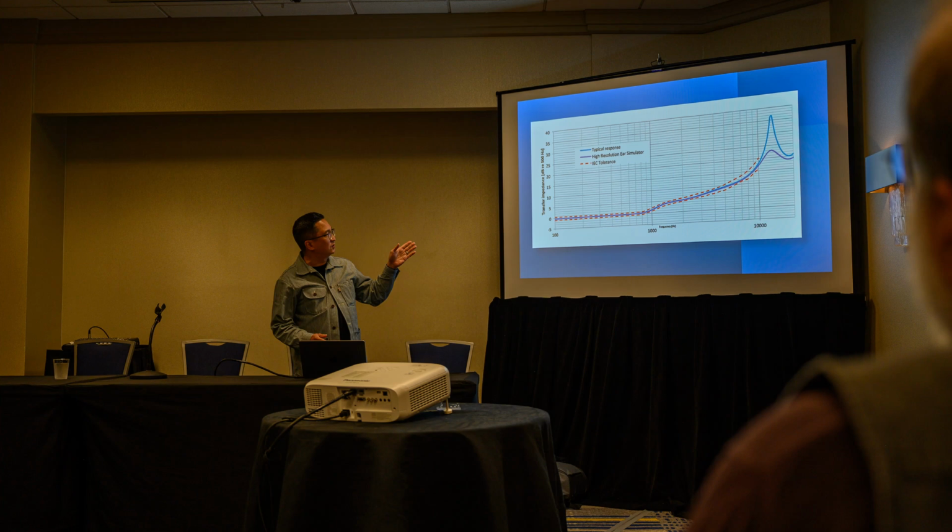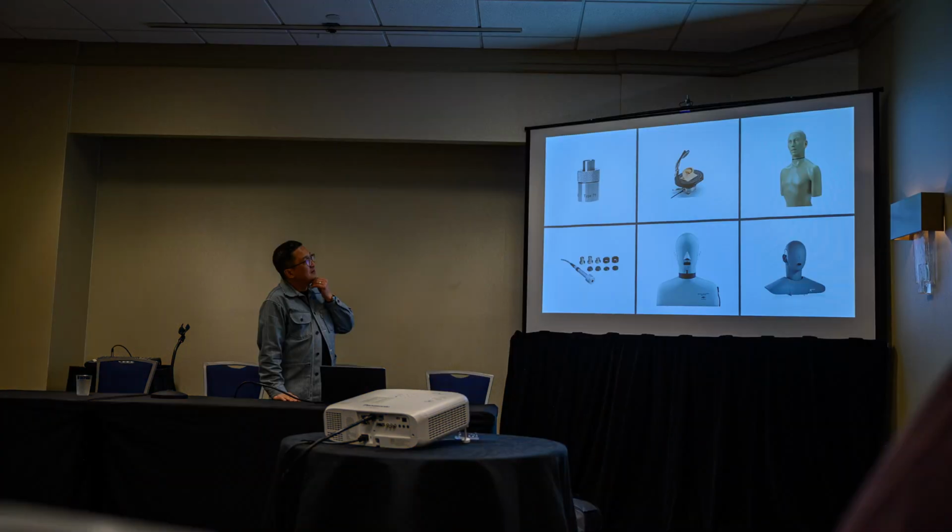So then you have this situation with 711, and we're going to get to this and show how it manifests itself sometimes, maybe in a really key standard or a key piece of research. With 711, you have all these different ways to use it, because it was really made as an ear simulator for insert devices. But what do you do if you want to measure something else? You have to come up with some way to couple it, and it was the best thing available. So they came up with the mannequins. KEMAR actually came out before 711, but the 4128 on the bottom middle there came out, I think, in 1986. And even though they're 711 couplers or 711 fixtures, you're going to get different results.